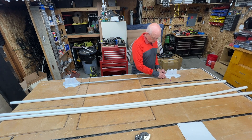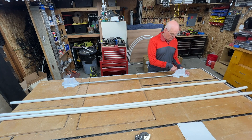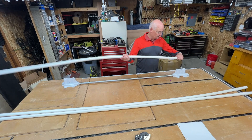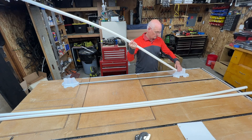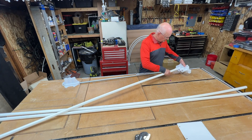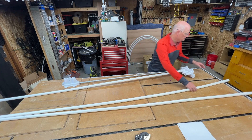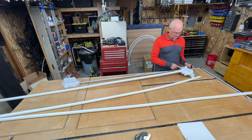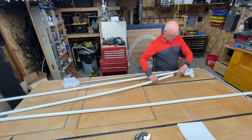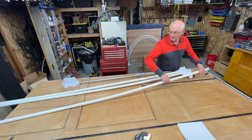I'm going to start on this end. I'll pull the M4 screw almost all the way out so I can see through the mount into the bottom of it — I need to do that so the cable for the strips actually goes through the bottom. One thing to keep in mind: on your ends of your connectors, they're going to be daisy-chained. You go in on the shortest one and then to the middle going back and forth, so you want opposite ends. The last one will be where you connect it up to the controller.